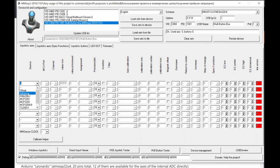I usually use the internal sensor setting — the Arduino's built-in 10-bit analog-to-digital converter. It's less resolution than 12-bit or 16-bit external chips, but at 10 bits the accuracy is roughly 0.1 to 0.3 millimeters of movement, which is quite sufficient for most controller applications, especially since potentiometers themselves often aren't that precise.